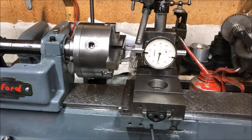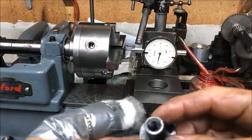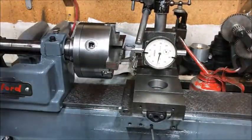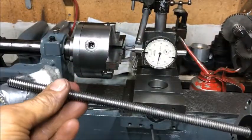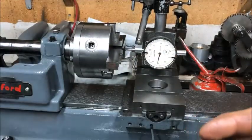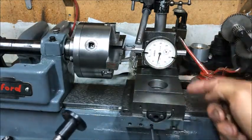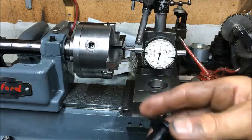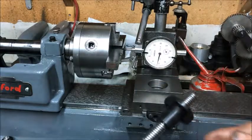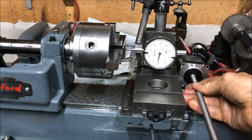I was also taking time to make a new nut — just this plastic type that came with the stepper and the lead screw. There will be a pair of them, one at the rear and one at the front, so I can adjust if they get worn. The slop plate and these will then guide the cross slide using the ELS.